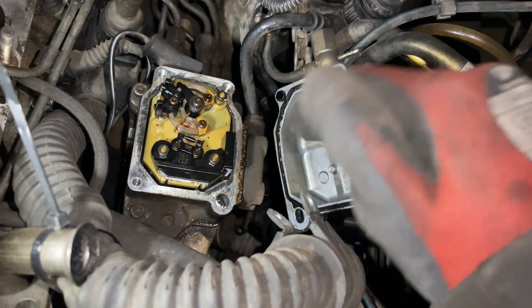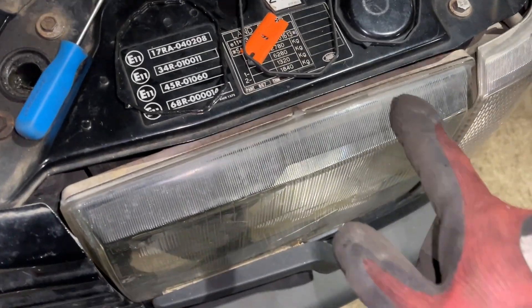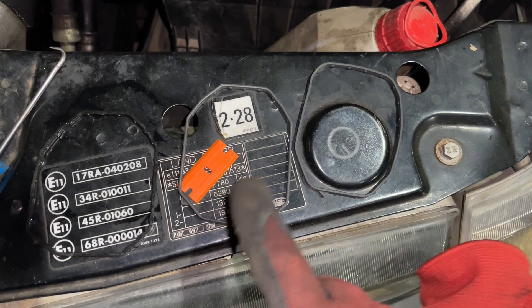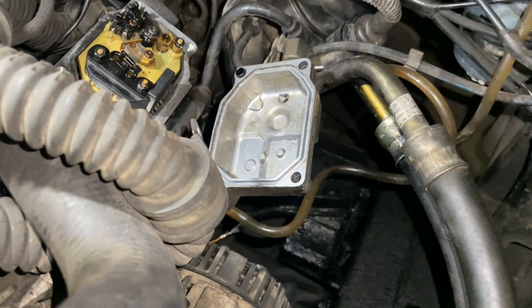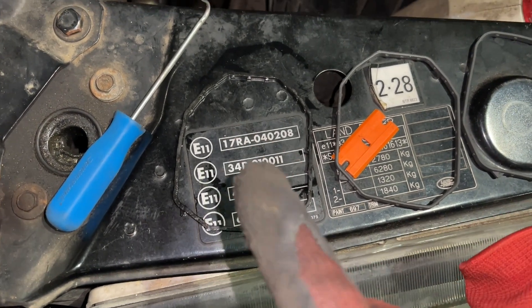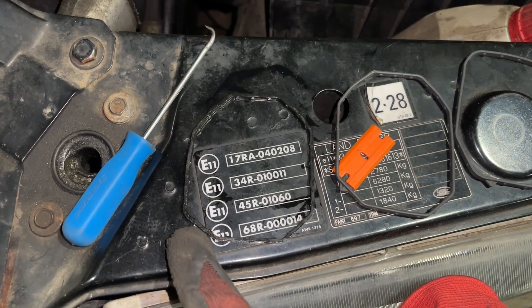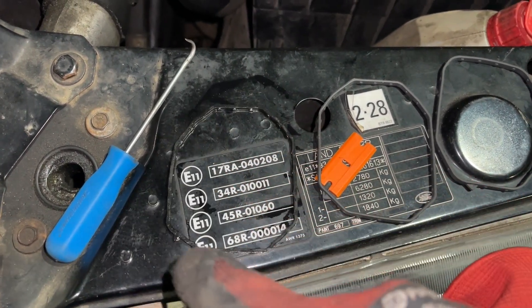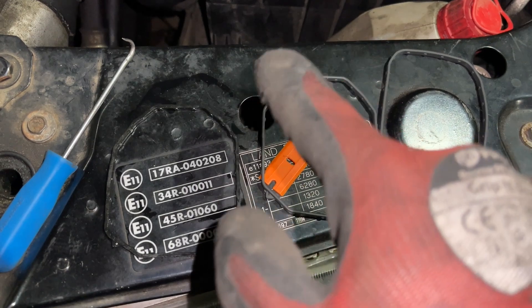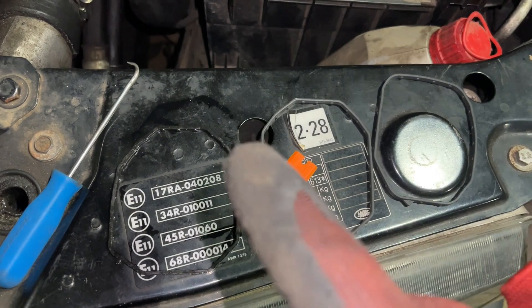We're going to clean this surface up very carefully and replace the gasket. We've got two gaskets in the set — this one is obviously the same shape as the one I took off the top lid but a lot thicker and newer. The little tab on the corner is to get a hook under and pull the old seal out without damaging the seating face. I just need to put a bit of diesel or oil on the new one to let it seal properly, then put it back in the housing and put the top back on before taking the next bit off.